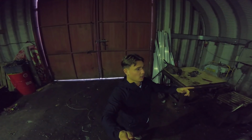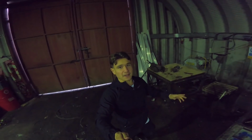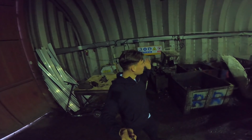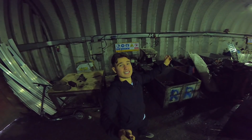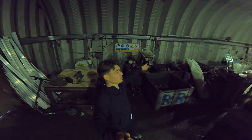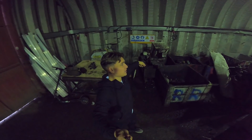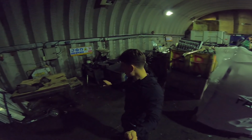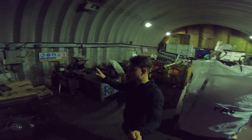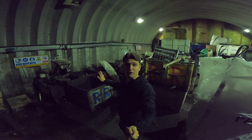The next option I have is to leave it, which isn't an option, and then I could also go outside, tidy up the outside there, but it's super tight and really hard to get to because of the shape of this. It's a circular shape, so it's really tight down that side, and clean all that shit out, but I don't have anybody that would be willing to do that. So I would think the best option to do would be to re-concrete it and put a bin in there and then empty the bin when it gets filled up with the water. That's what I feel like the best option is.